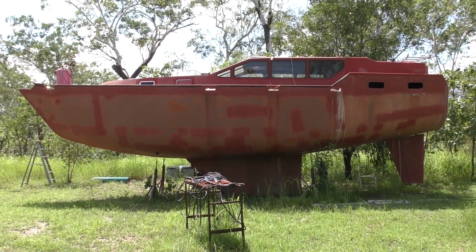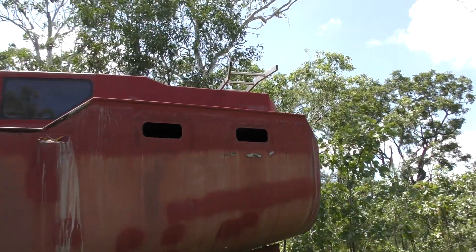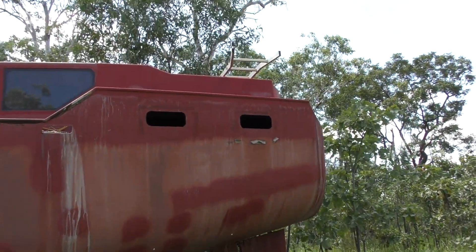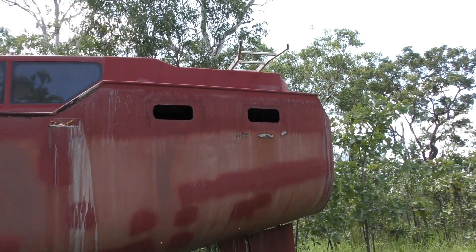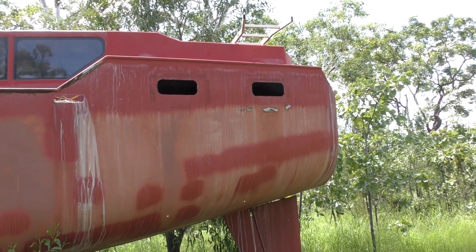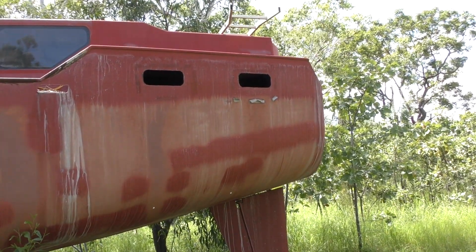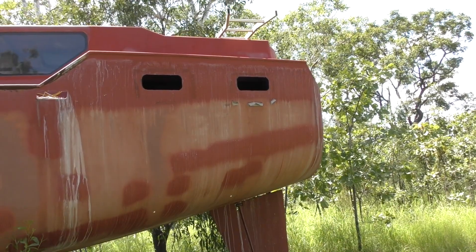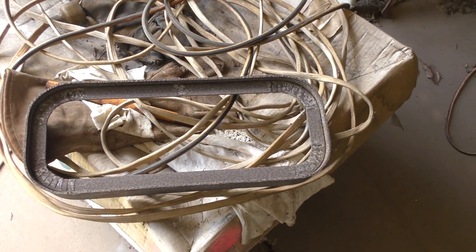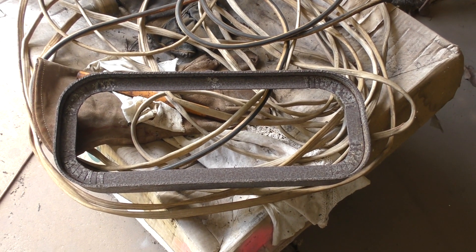There's still a lot to do before I can really start to progress the fit-out. Following the shade cover, the next step will be to get the four rear fixed port lights fitted into each side — the ones in the rear berth under the poop deck. I want to get the frames put in and the perspex windows fitted. We did toy with the idea of making them openers but it's quite complicated and quite expensive, so I don't think that's a good idea.